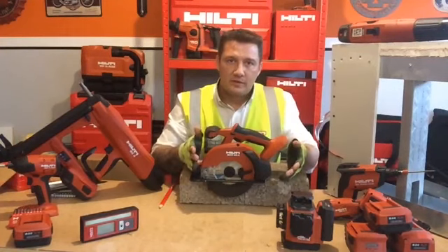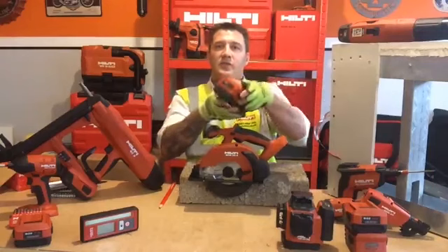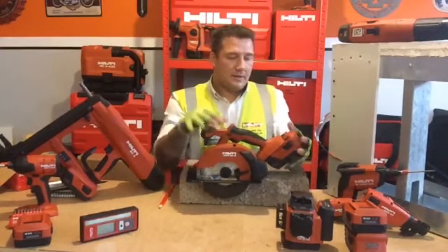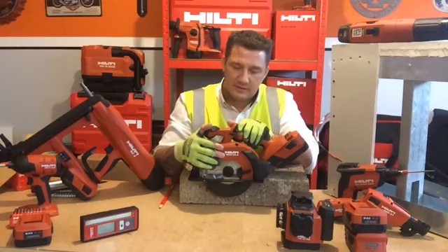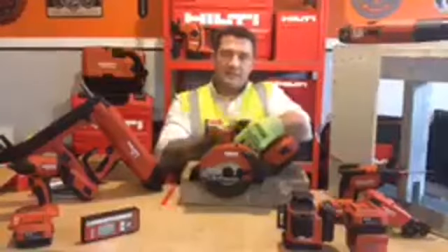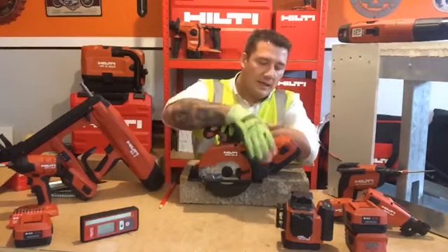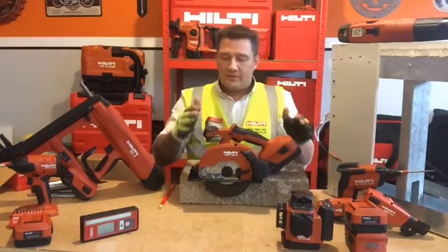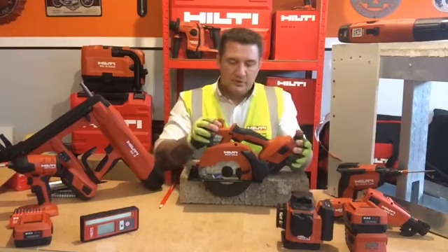Now this isn't a new product and a lot of you will be familiar with it, but are you fully aware of all the benefits it can bring to your tool park? First off, it sits on our 22-volt platform and today we're going to use the new 8-amp battery with enhanced cell technology. It uses a 165mm blade giving you a maximum cutting depth of 57mm, but it's got a blade stop speed when you take your finger off the trigger of only 0.5 of a second. It also has a safety feature — you can't just use it with the trigger; you have to push the safety release button first, which also operates an LED for accuracy. It also collects all the metal shards right here, which is better for the environment and safer for the user. And the main feature is that it's a cold cut saw — no sparks, no need for hot works permits. It's a simple use-anywhere-on-site tool.